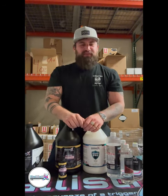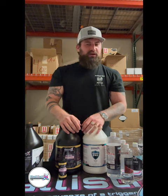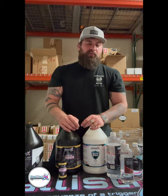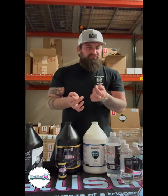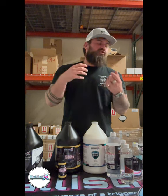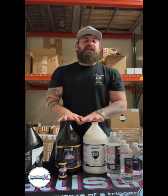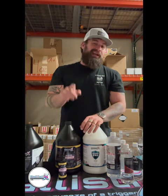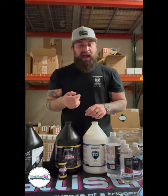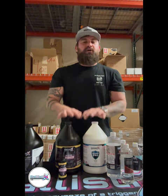In this segment, we're talking specifically to polishers and decorative concrete contractors. We have specially developed our own pre-sealers that are compatible with our Ballistix line — the days of intricacies and failures are over. Ballistix's biggest problem in the past with grind and seal was that we couldn't recommend one-size-fits-all pre-sealers. Folks were using solvent-based urethanes or solvent-based acrylics, not understanding that our products could re-emulsify them — causing delamination. Our product forms a covalent bond to the surface, which means unless the surface comes up, the product's not coming up. If our product comes up, there's probably something underneath — wax, a urethane, or an acrylic. We've taken all the response from our customers and developed our own pre-sealers.